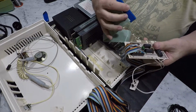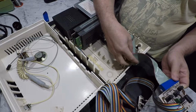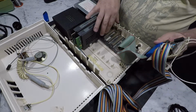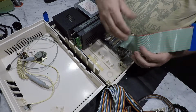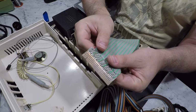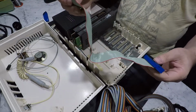And then when they were developing, if you can call it that, this card, maybe the card was sort of plugged in like that, so they could have it out on the bench and work on it, rather than trying to debug it while it was sitting up vertically in the chassis. So I'm guessing that's probably what this is for. It's probably just a bus extension that's fairly corroded and gnarly looking. It'd need a good cleanup if you're ever going to use it, but yeah, I'm guessing that's what it was intended to be.